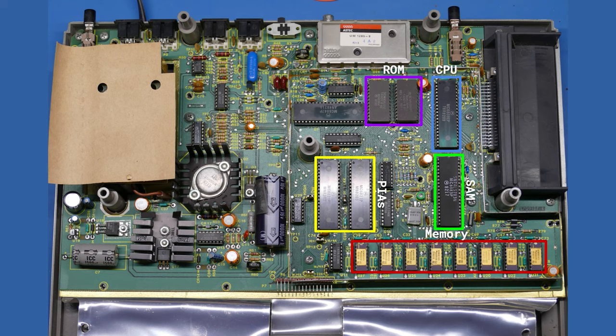What that means though is that this does not have a synthesizer chip similar to the SID on the Commodore 64. All of the sound generation is handled basically by the CPU in concert with that digital to analog conversion chip. So that means that when you're playing a game, when you have to create a sound, the system kind of pauses. And there's some creative workarounds to make things look more smoothly, of course, but it's just one thing to keep in mind. There's no synthesizer chip, but some of the sound that you can get out of this system is actually pretty impressive.